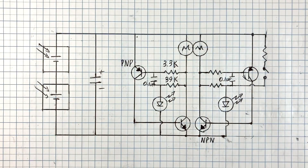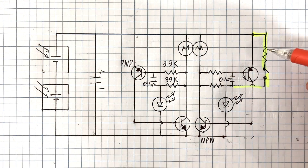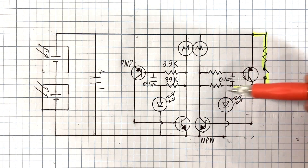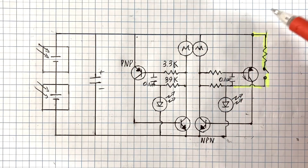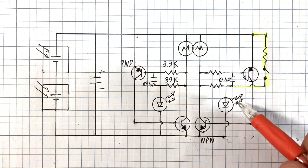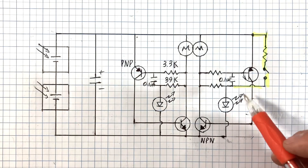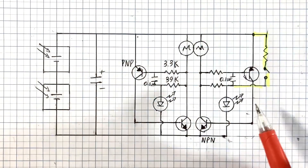I also added a touch circuit to both sides — it was easier to show just one. This is a small 33 kilo-ohm resistor connected to a touch sensor. When the robot bumps into something, it closes the sensor and essentially bypasses the motor and the main resistor with a slightly smaller value, pushing the turn-on voltage for that side lower than the other, making it much more likely to fire so the robot turns away from whatever it's bumping into. It can't reverse since there's no reversing circuitry, but it helps the robot avoid walls. One last note: in very bright light the flashing LED might never turn on regardless of voltage. If this happens, put a small piece of heat shrink or tape over the LED to shade it — do this for both sides to increase the light range your robot works in.